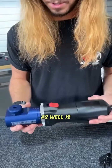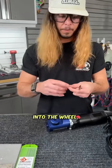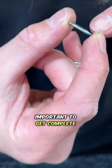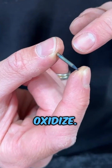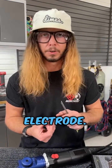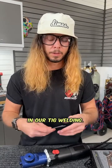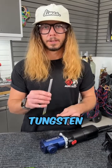Something really important: never force your electrode into the grinding wheel. Forcing the tungsten into the wheel will burn and oxidize the electrode tip. Right here you can see an oxidized tip that I've removed. If your tungsten has color on it, discard it and start fresh — that oxidized layer causes interference with electricity and adds resistance on your electrode, which is not what we want. This is my favorite way to produce a completely repeatable, consistent, perfect tungsten every time.